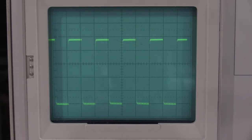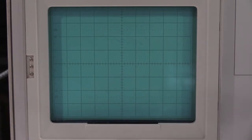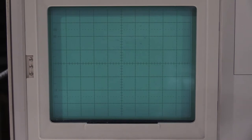That should only be 4 divisions, and it's almost 5. So there may be more problems with this plug-in. That is just sometimes the way it goes. Well, the Rigol says calibrator's working, so time to go digging in the plug-in some more. This one's going to fight. Well, we'll get it. I will be back if I find anything interesting.